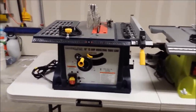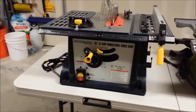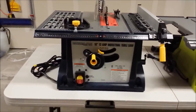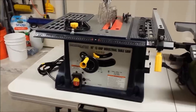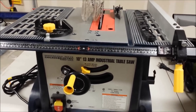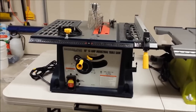Let's take a look at the specifications on these two saws. First, the Harbor Freight. The most current model available online is the 63118, which happens to be red instead of the blue you see here. That one is 15 amps. It'll cut at zero bevel 3 inches, and at 45-degree bevel about 2½ inches. RPMs are roughly 4,800. Weight is about 45 pounds. Rip left is 12⅛ inches, rip right is 9¾. It accepts dado and has a separate dado insert. Warranty is 90 days. Table size is 26 by 19, and it retails online for about $139, coming with a metal stand that is not collapsible.